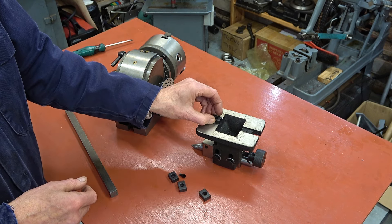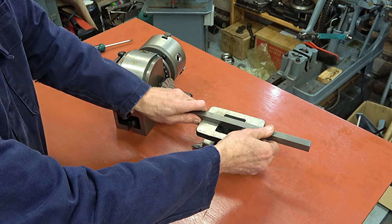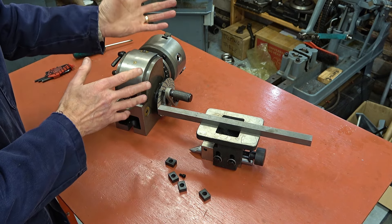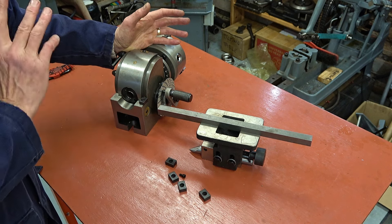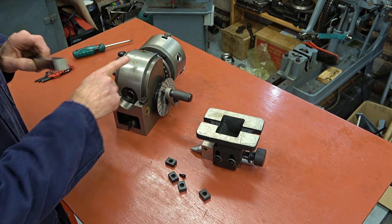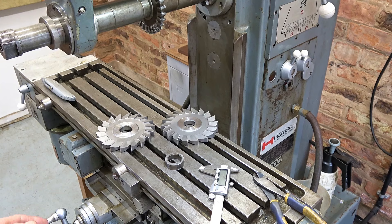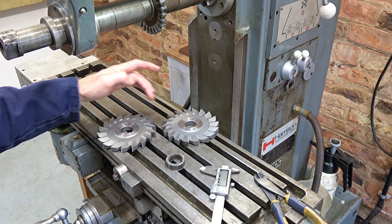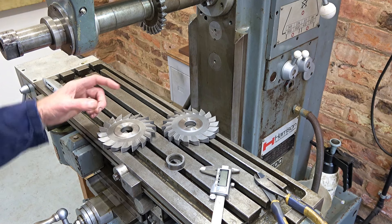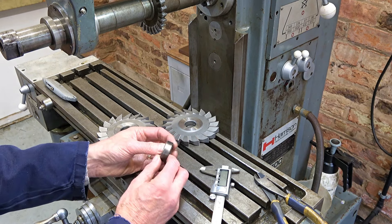These tools are good value but they often need a bit of tweaking. I've got some 16mm square bright bar which will just nicely drop into those slots. It's a little bit loose in some slots but I think it'll be fine. The project is to cut some tramming blocks to fit both machines, done mainly on the Harrison Mill in horizontal mode. I was given two matching brand new side and face cutters — five inch by half inch for a one inch arbor with a quarter key — and I'm going to cut the tramming blocks into a T-shape using these.